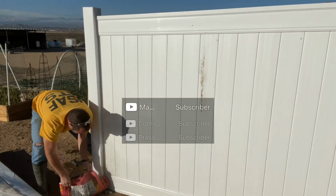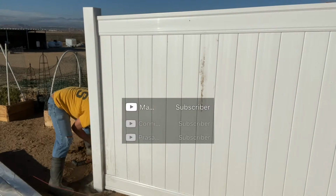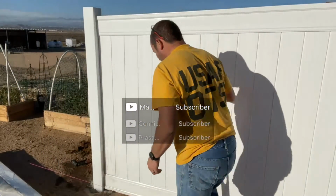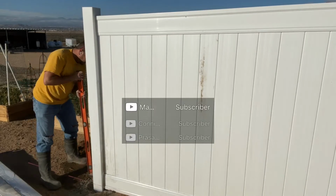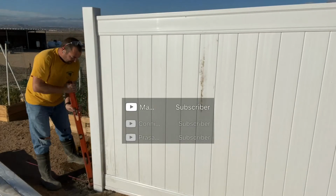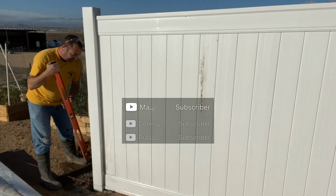Okay, make sure to get concrete in there on all sides. Some of them are harder to get in, smaller and thinner spots, but it's important to get it all around. Okay, and my trick to make sure it's packed down a little bit is, there's a tool for this, but I don't have it. So I'll use my level here, because you don't want the inside of the hole or the concrete to be above the outside ground, because you want to keep a little bit of water as it's drying. If that makes any sense. So I'm moving this around in here. You could use a stick too. That works better, but whatever.